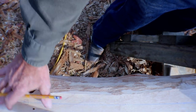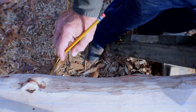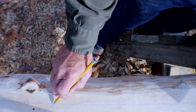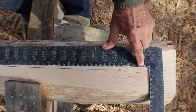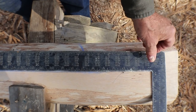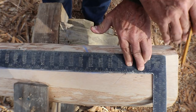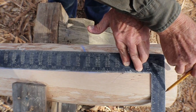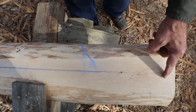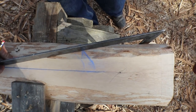This log will be cut off in this area here after I get my exact length. I'll start from the butt end and do the same thing — mark it with a pencil on the chalk line. You can see my center line here. I'm going to line that up on the inside of the long leg of my square on both ends on that snapped line, then mark on this side. This will be my cutoff right here.